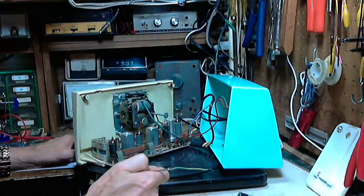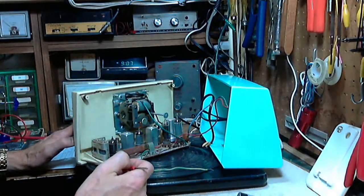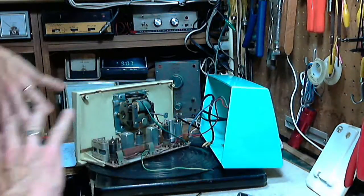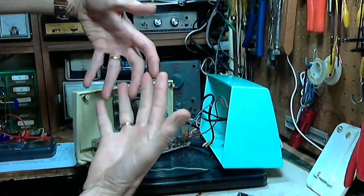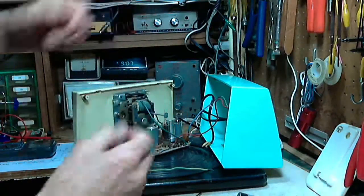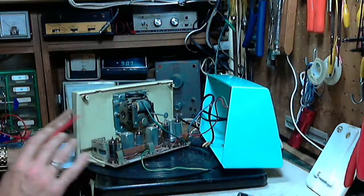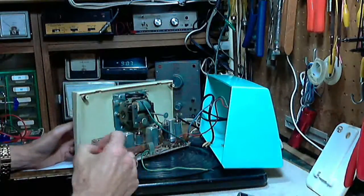It's not likely to be dirt or something like that. It's much more likely to be a direct plate-to-plate contact. And I had seen these where the whole capacitor is out of alignment. The plates, instead of passing through the center, they're all over to the edge, and any one of them can make a contact. And you can't see any of them bent or anything out of the ordinary. It's just the whole set of them can be over slightly.